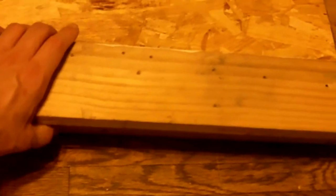Next, we're gonna put a shelf on the front to set soda cans and everything on. So also got a 1x4, again, 3.5 inches. Cut this one a little shorter. It's 24 inches instead of 25. So it will fit inside here. And we're just gonna set it on here like this. And we're just gonna nail it down to here with the nail gun.